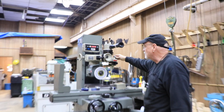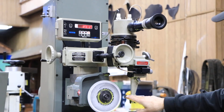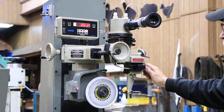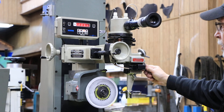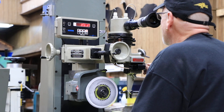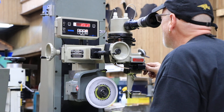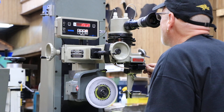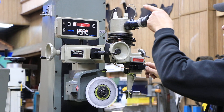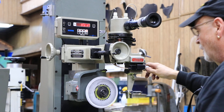You have several different scales going on here: you have this tangent, the green number here, your diamond holder, and another transducer that gives you your radius — how much you're feeding in. You look through here and you can actually see your diamond and what radius it is as you bring the diamond to that section of the little chart you see in here.